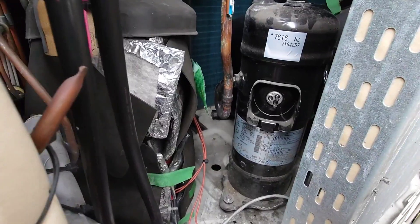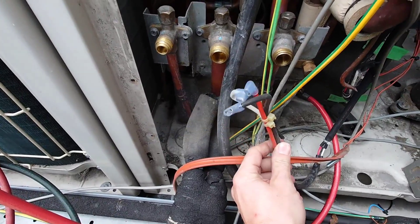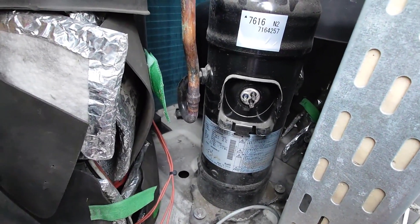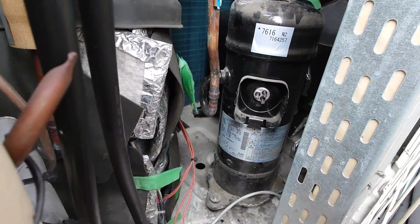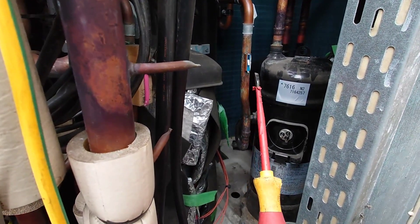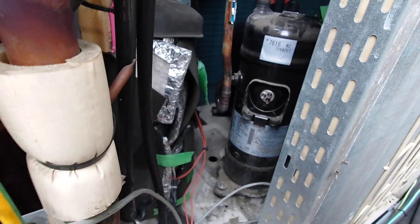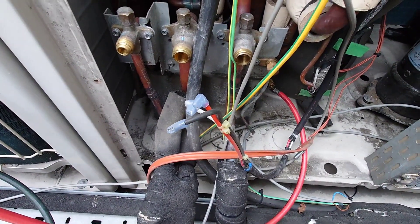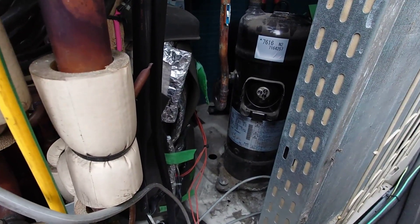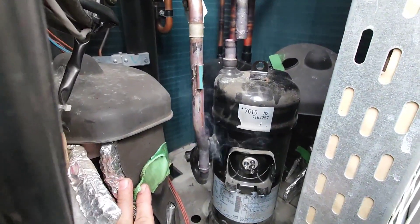There's the compressor disconnected — we've taken off the crankcase heater and disconnected the cables. Take a picture of your cables so you know which way around they go; if not, you can always identify it on the other compressor, but they are labelled and it is on the wiring diagram. You've got one sensor on the discharge pipe to remove, one crankcase heater, and the mains cables going to the compressor. Just a point to note when removing cables: give it 10 minutes after turning the power off because the capacitors inside will need time to discharge. Although the power is dead they will hold a charge and give you a belt if you're not careful.